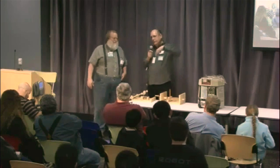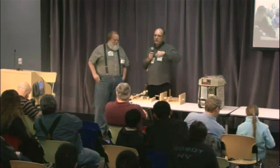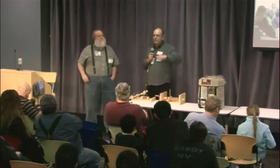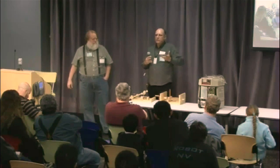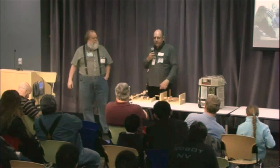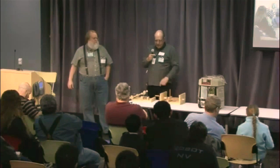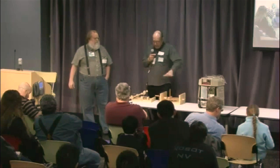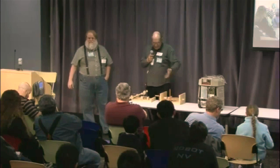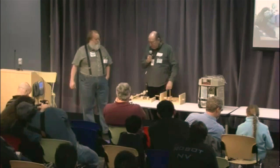Eventually, I figured it out: the reciprocator mechanism that he uses to convert continuous rotation into back and forth is basically the rocker bogie mechanism that you use to level a Mars rover. It's just an inversion of that thing. So basically, anything we know that we need to solve mechanically has been done 500 years ago, and we just need to go back to sort of reexamine that.